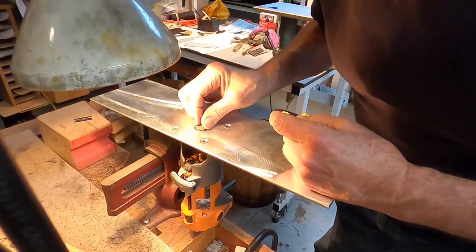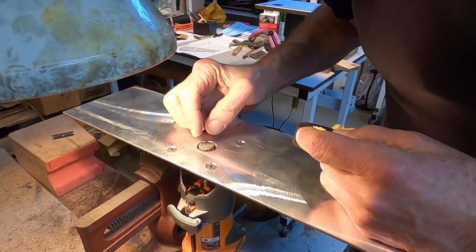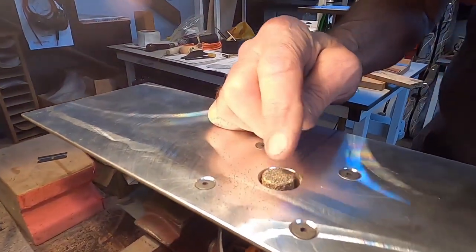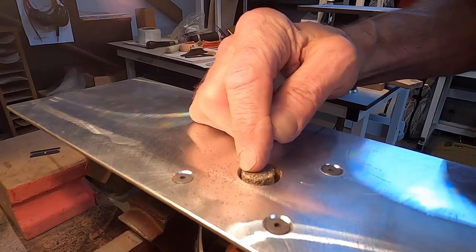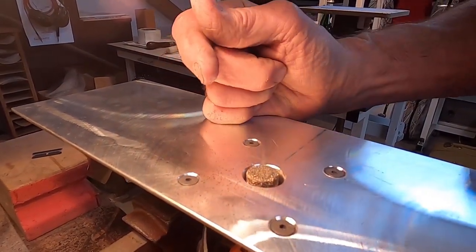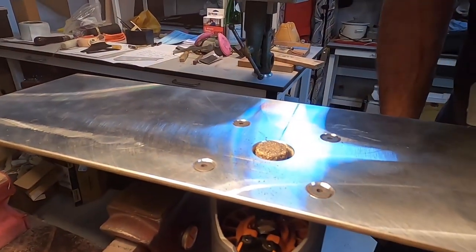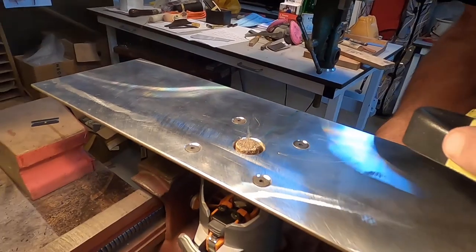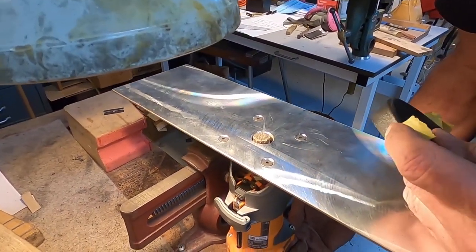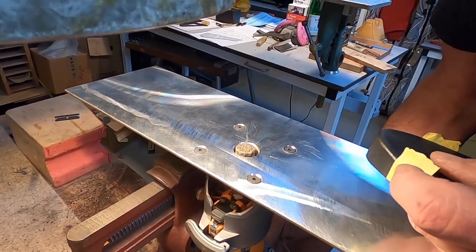Okay, so we have a cutter that's an abrasive slurry that's bonded onto a steel shape, and the grains, I believe, are tungsten carbide, and we're going to run it in this little laminate trimmer at whatever it is, 25,000 RPM, a little faster than it wants to go, but it cuts pretty well, and you'll see.